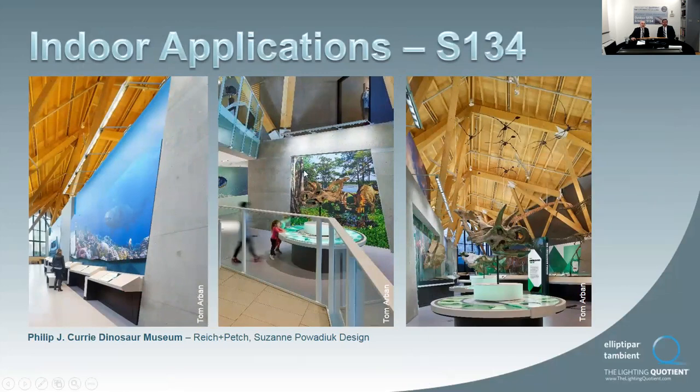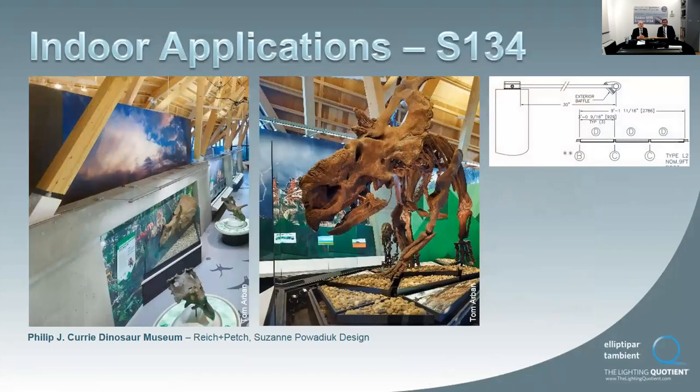But the main reason it was asked for was, in situations like this, they wanted to limit the lateral spread that we normally have to minimize light that fell on the raw concrete bookends. So what that meant in terms of fixture appearance, if you look at the right-hand shot, especially with that cross baffle, having the fracture optics intermittently sort of gave you the sense of light, dark, light, dark. Once again, with the new continuous optics, that would have a much more uniform look over its entire length.